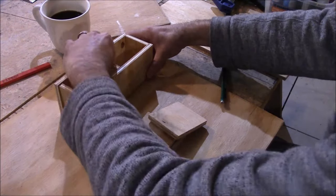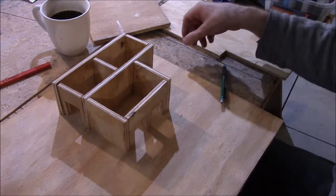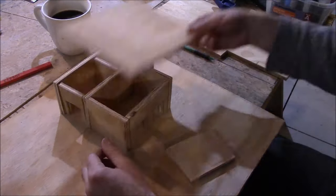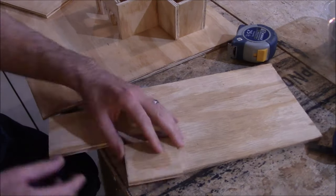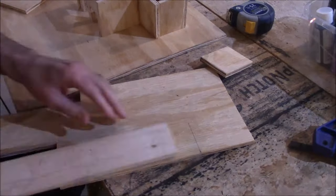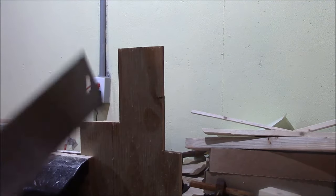Now, the plans I have on my website are dimensioned to my final dimension, so what's there is exactly what I did build, if you're just trying to recreate what I did. Initially, I wanted to put an extra support piece where the ramp was going to go, because I was afraid the plywood would flex a lot if someone pressed on it. It's very foreseeable that some kid's going to try to stand on your little car ramp made of plywood, so I thought whatever I could do to strengthen it would be a good thing. After building this, I don't think that extra support piece was necessary at all. Even though it's shown in this video, I did not put it in the plans, because 3/8 plywood was more than strong enough.